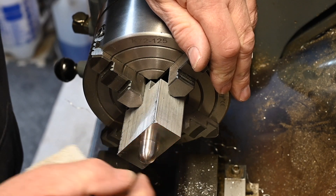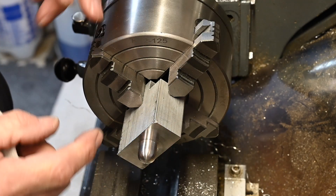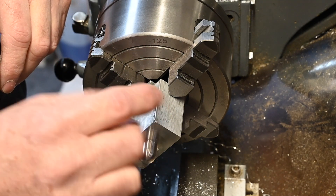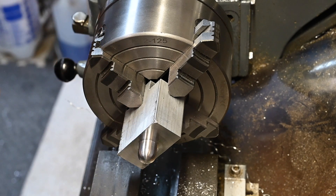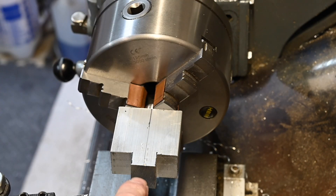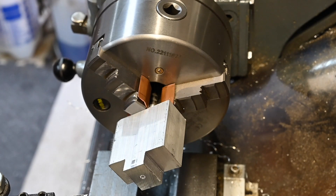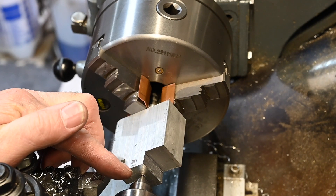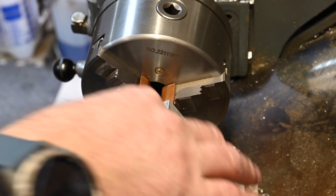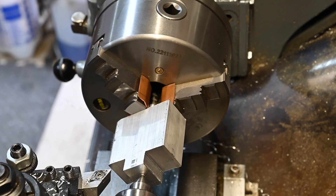That's turned out quite nicely. Because I've got this piece here I can take the four-jaw out, which will make it easier. I can put this in a three-jaw and then the concentricity for the other end — which doesn't have to be 100% — should be as good as I can get it even if I've dialed it in in the four-jaw. So that's my plan. I'm just going to put some little copper jaws on and put a bit of tail support in there initially until I get this down to size. When it comes to doing the threaded part and the hole through, I'll take the tail support out obviously.